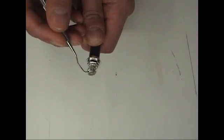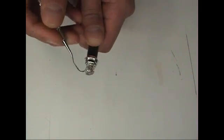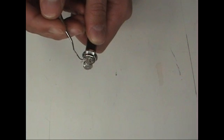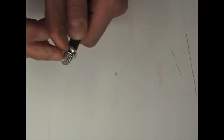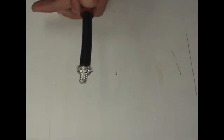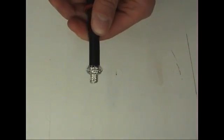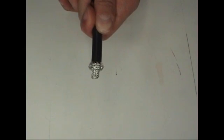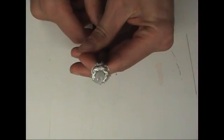RG214 cable has two layers of braid. Unbraid the first layer and comb out the braid wires smoothly over the clamp. Notice that the interweaving of the braid is preserved — this will add maximum strength to the connector. And here's both layers folded back.